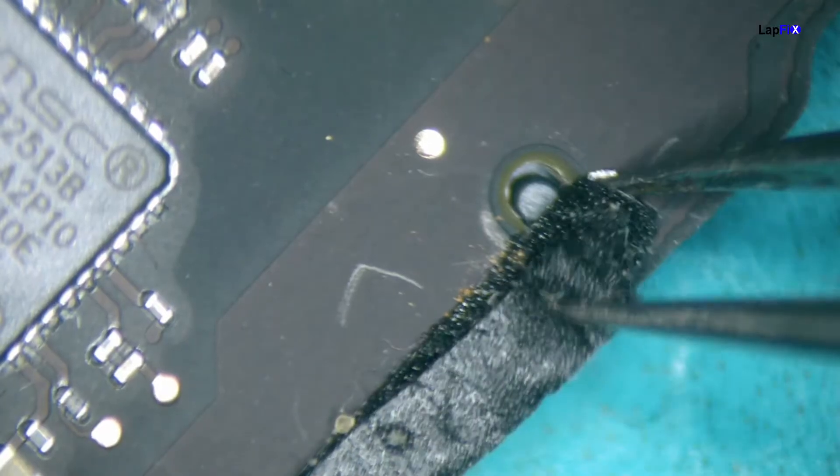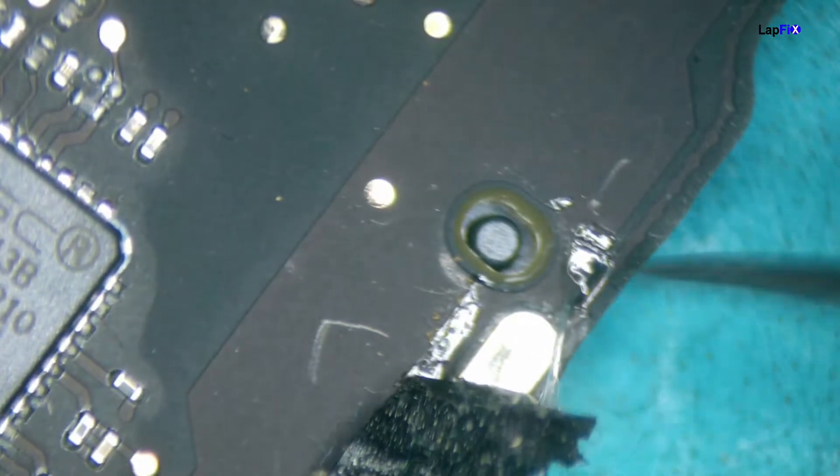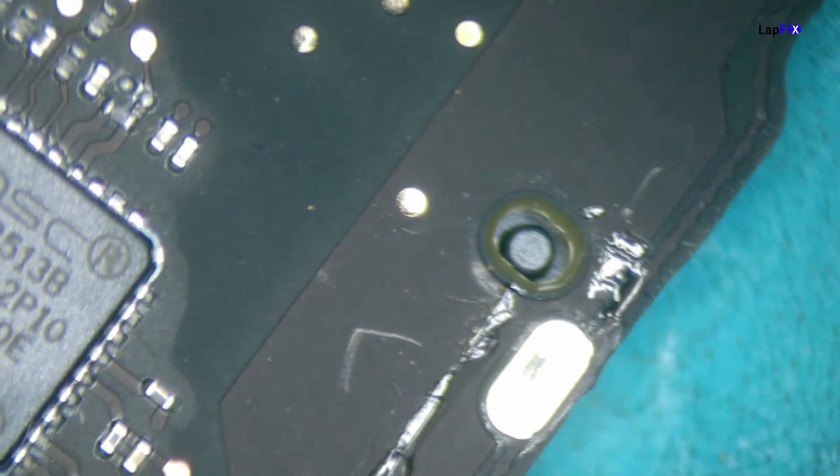You can see all the little solder balls there, but it's a little difficult to see the rest because they're right next to each other. Let's remove this strip with a small tweezer and do some cleanup work — peel it all the way across and see if there's any damage underneath. The solder balls look to be pretty much intact on the edges, but we can only see the edges, not the actual middle. The best way to address this is to do a reflow.